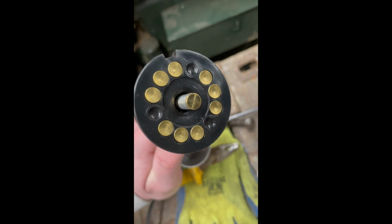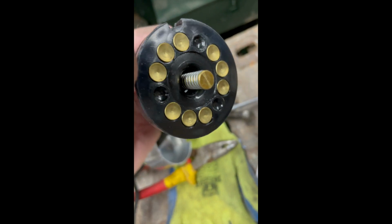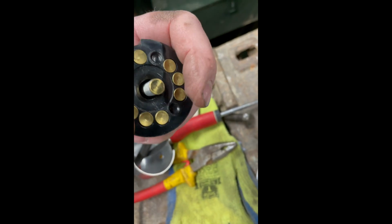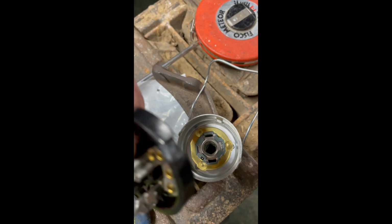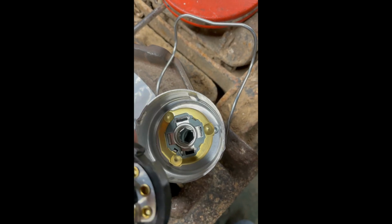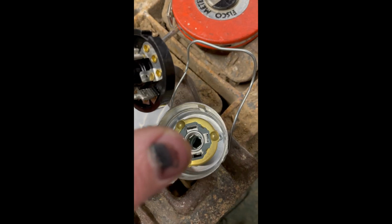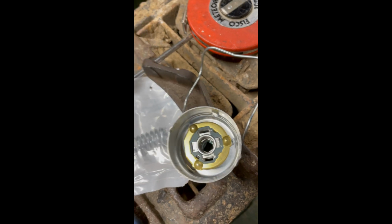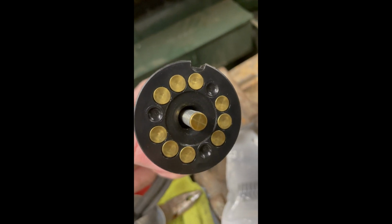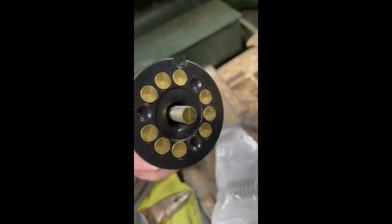As you can see, there's also an off position, which is the black plastic divots, one, two, and the third one there, which is in the off position. So operating this switch, as you can see, it's got a detent in the top there, which makes it stay in place, and that lines up with that one there. So you have to work out that ring effectively in the switch is the one that passes the current in sequence across any one of those contacts.